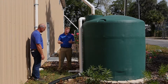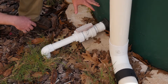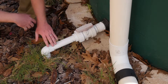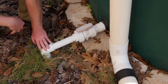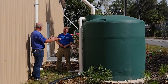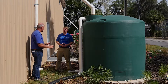We also have this connected to a pumping system providing irrigation to this landscape on a regular basis. Here is the outlet where the cistern discharges to the pumping system. We have a valve here that can be closed if the cistern needs to be taken offline for maintenance, and here is the connection that goes on to the irrigation and pumping system. When the pump kicks on — which typically would be supplied by potable water or a groundwater well — instead it's tapped into this water captured during a rain event. So we're essentially saving on groundwater while still irrigating the landscape — a great opportunity for rainwater harvesting.